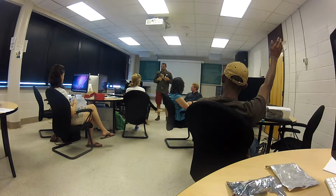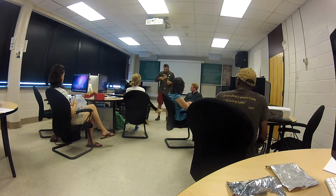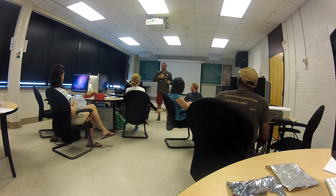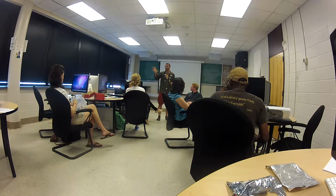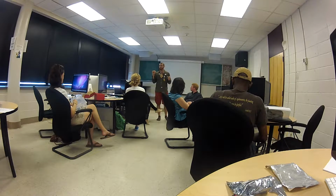So we have this battery right here. It's powering this tiny computer. And this tiny computer has a strip coming out of it that's hooked up to this LED. One side of the LED, the negative side, is going to the ground of the battery. But the other side is going to a pin on the microcontroller itself. And we make a very simple program that just says, whenever I send something up on this pin, then I want you to go to this pin right here, which I think is pin number 0, they call it. And I tell that pin, flash on for 250 milliseconds, flash off for 500 milliseconds, flash on for 100 milliseconds, flash off for 300 milliseconds. So you can actually program this little behavior right there. And so right now, that little flash right there, that is doing a Jamaican firefly's mating call of the male genes.